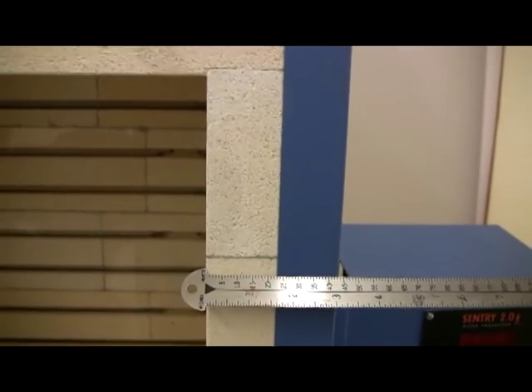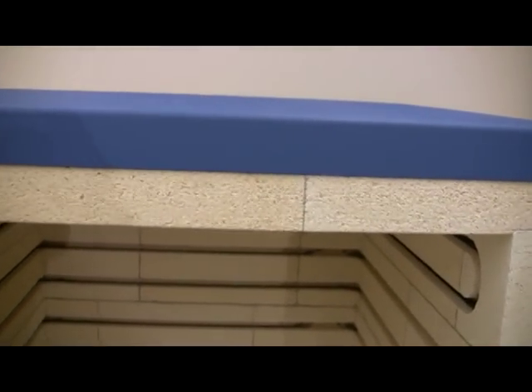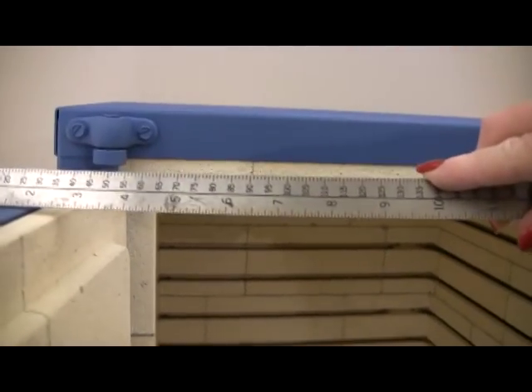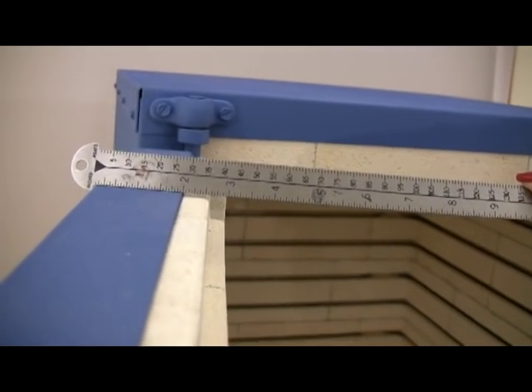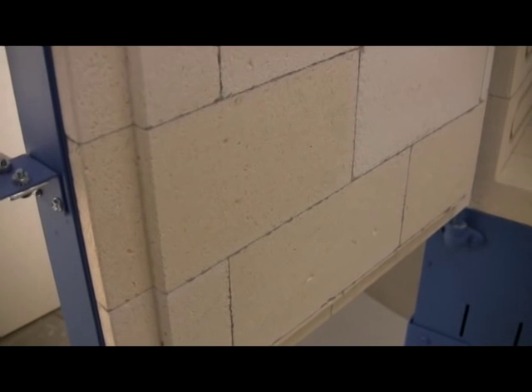The Iguana is made from 3-inch thick fire bricks that store heat for slow cooling. The 3-inch fire bricks have 20% more insulation for energy savings than the standard 2-and-a-half-inch bricks. The inner door surface is recessed to prevent radiant heat loss.